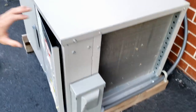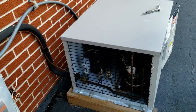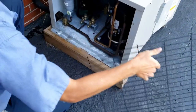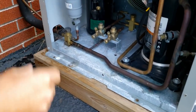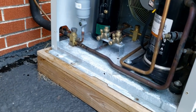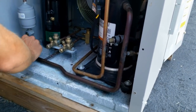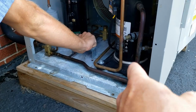Pop the rear cover off, get into it, take that little cap cover off. The sight glass is right there — it's underneath that white and green thing. I always like to check my caps and make sure they're tightened back up. It looks solid — I don't see any bubbles, which is never a bad thing. Make sure all caps are tight; that inside one always gets forgotten. If you can untighten it with your hand, it's not tight.